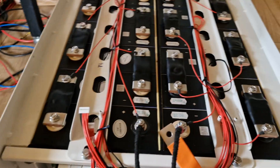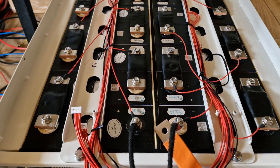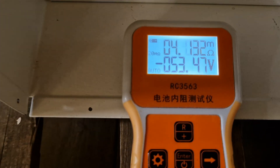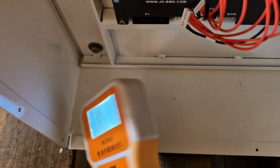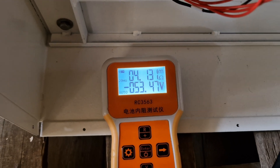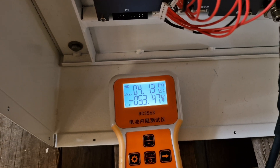It's like double. So it has some influence, and like we saw last time it is about 0.4 milli-ohm improvement. I want to show you what is actually the resistance on the pack. You see it is even going a little bit lower, because when the measurement device gets a little bit warm it also gets better. So measuring at those 413 — I think it is exactly — and when you divide it by 16 you get 258 micro-ohm per cell.